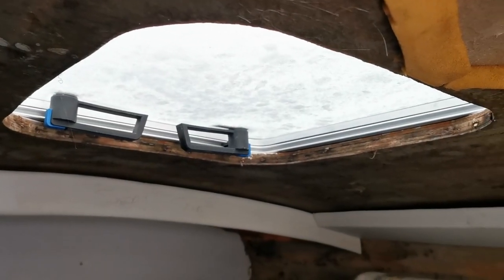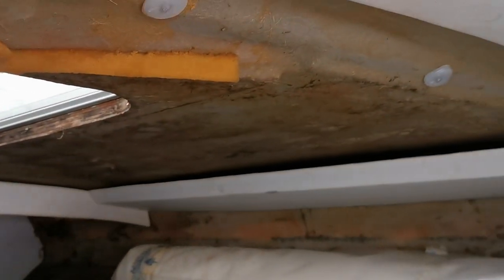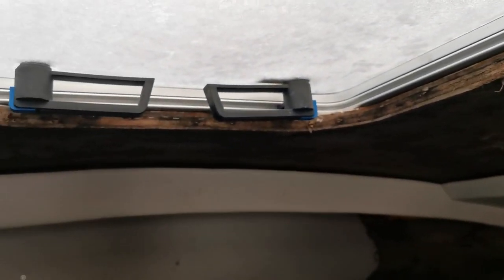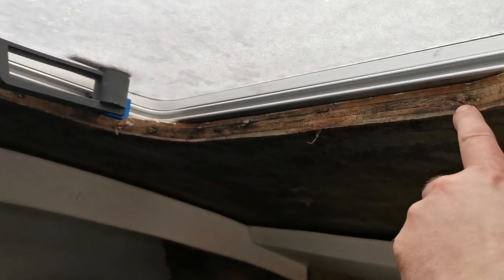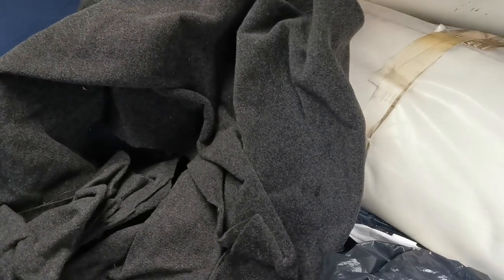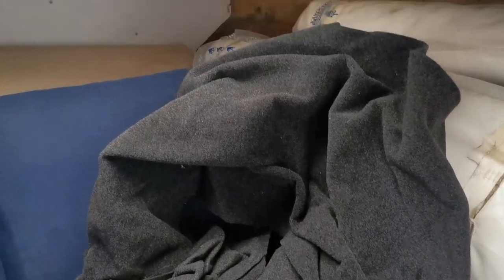So let's go inside - maybe a little bit dark till the camera adjusts. You've got a nice little area, a little V-berth. This converts to a bed. There's a table there which should sit up on the post. You can see a lot of the interior has come out. I think that's because this hatch covered in frost has probably been leaking. The interior in here is the last thing I do - I just want to get it working first of all. I'll make a panel to go over this. That hatch needs to come off and be sealed all around the edge, and this raw edge I'll probably just flow coat over. I know lurking under there there's a big mouldy patch which makes me think the hatch has been leaking.